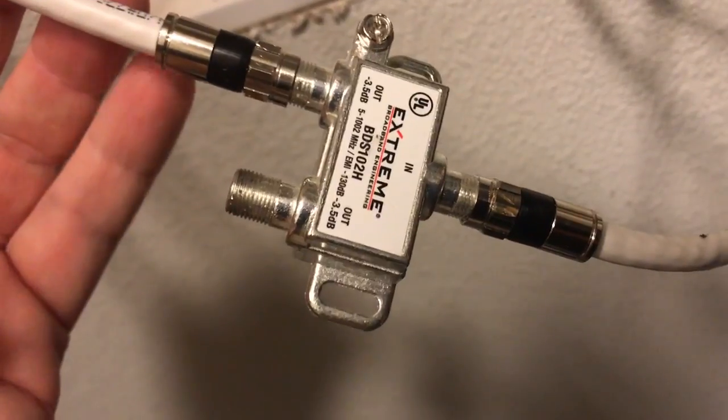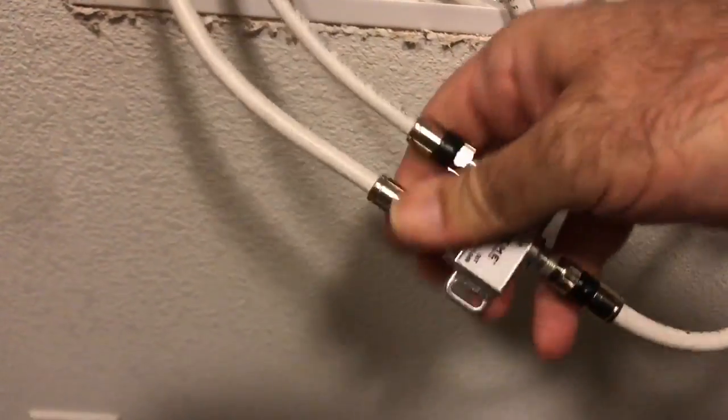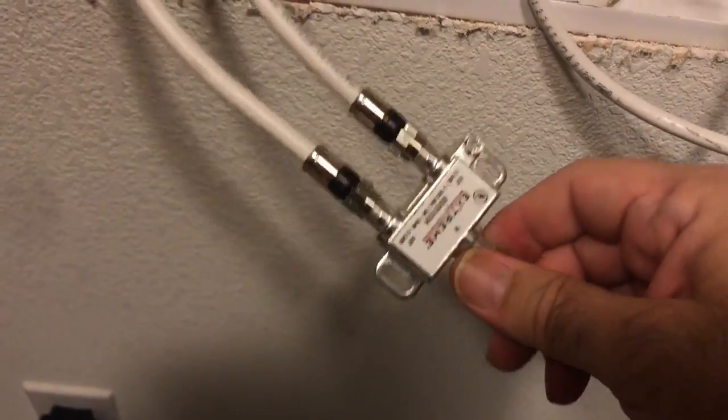This one here says family — it's connected up to the family room where the TV is. I have two hands now but the camera is like on my chin. So here we got the first cable; we'll connect the splitter where it says 'out' and we'll put the second cable in, and we're done. Make sure these joints are tight. Sometimes you might want to use a little pair of pliers and make them very, very gently tight.